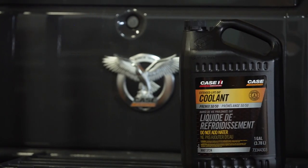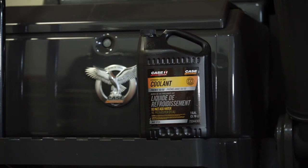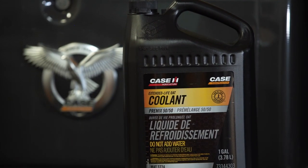Check your cooling system. Our Tier 4 machines use organic additive technology (OAT) coolant — if your machine uses OAT coolant, it must only be topped off with OAT; mixing OAT with non-OAT coolant leads to gelling. Check and test your batteries, especially if the machine sat idle all winter. Use genuine Case Magna Power batteries, designed specifically for Case equipment. Always use genuine Case OEM parts — oils, hydraulic fluids, transmission fluids, and batteries are all designed specifically for Case machines.